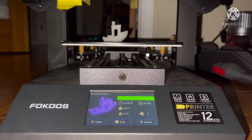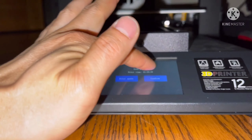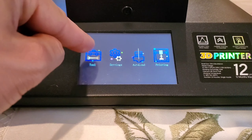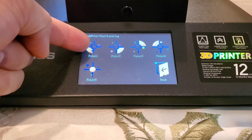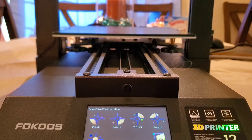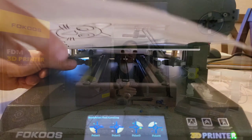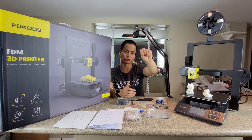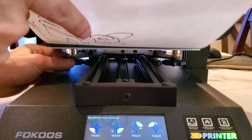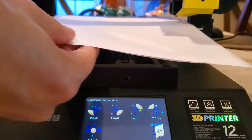Let's talk about the interface. It's a 3.5-inch full color display, which makes it very easy to navigate the different menus. Once you get everything built, the next thing is to calibrate the machine — it's recommended to calibrate whenever you move it. All you have to do is take a standard A4 printing paper, put it on the bed, go through the calibration menu, and start from the top right corner. Slide the paper around until the extruder touches it, and bring it down until you feel slight resistance. Use your pointer and thumb to feel it — don't grab the paper too hard. If you put the extruder down too much, you will scratch the bed. Just use light pressure, go around in a circle, and you should be calibrated. The process is super easy using the thumb screws down below.